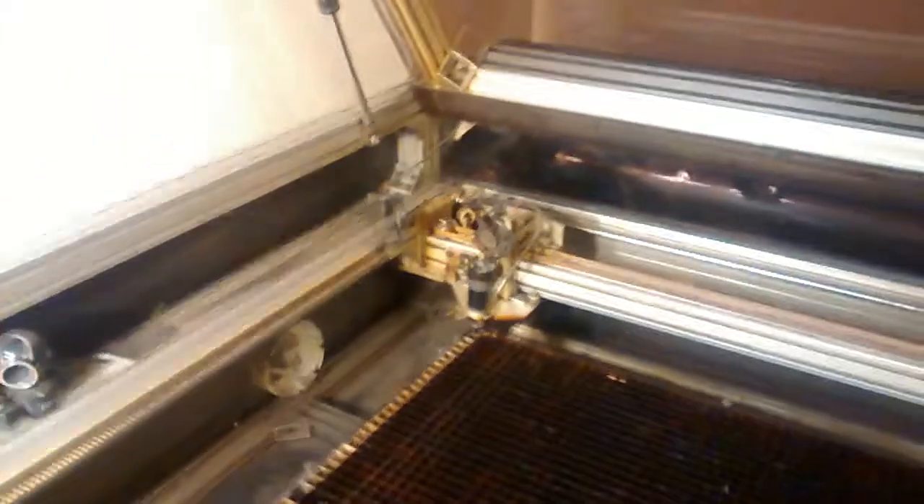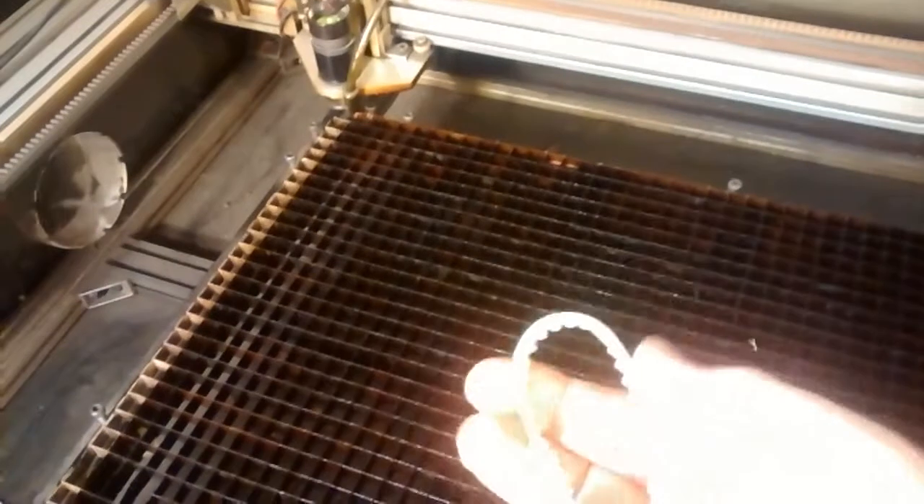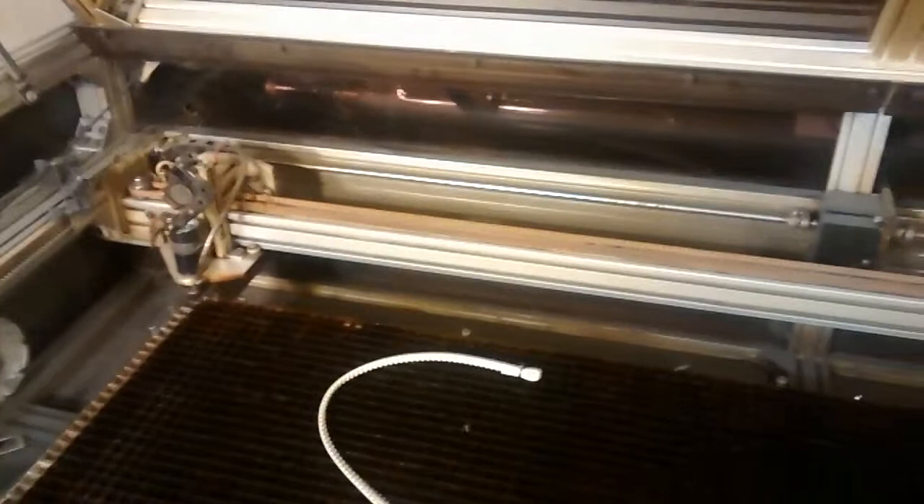When we decided to make a second laser cutter, we decided we would just make an exact duplicate of this one. The problem has always been these belts — let me show you — these belts that drive the machine backwards and forwards. The manufacturer changed to a new kind of belt that are a little bit stiffer and wider than the old ones. The result was that the engineering on this machine was such that it would tend to skip steps, and when that happens it completely ruins the cut.